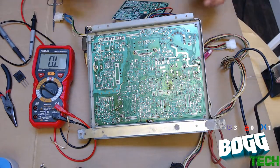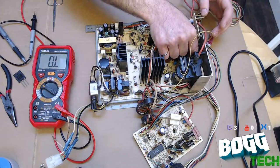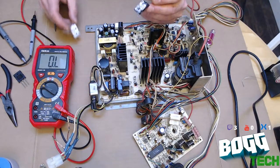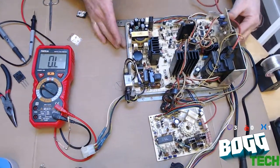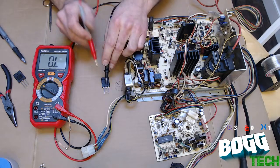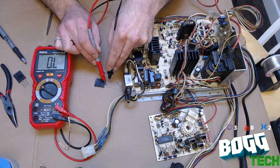Soldering iron away. I'm going to gently flip this over. We're going to pull that bad boy out of there. Okay, there we have it. There's the old one, chock full of thermal compound. We've elected to use PC thermal compound because I have it readily available, non-conductive. Works fine. Okay, so we have our potentially bad transistor. Let's use our resistance testing again. Oh yeah, no resistance. Go the other way. Yeah, she's fried. She is fried, folks.